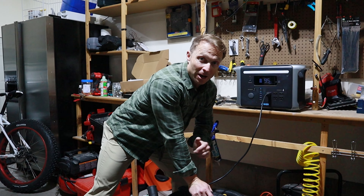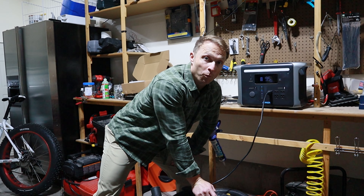The air compressor came in at 700 watts — an hour and a half of battery life. The shop vac came in at 910 watts for one hour of battery life. It's worth noting that the Powerhouse 757 can only put out a max of about 1,500 watts at any one time. If you're trying to use really power-hungry appliances, it may only be able to handle one at a time, so knowing each appliance's wattage helps you figure out how many things you can run simultaneously.